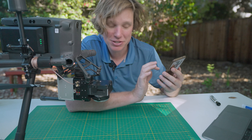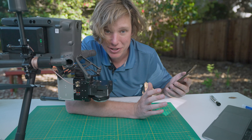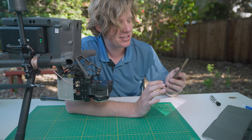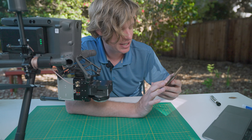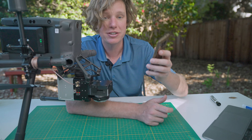To start the system, simply scroll down. First verify how many satellites you have — it should definitely be above eight, but ideally 15 to 20 satellites. Then see that the LiDAR is present, see that the camera model number is there, and then simply click start to start recording.